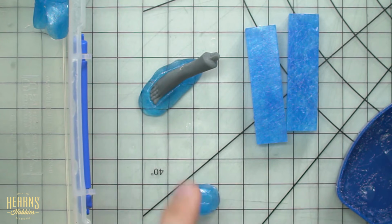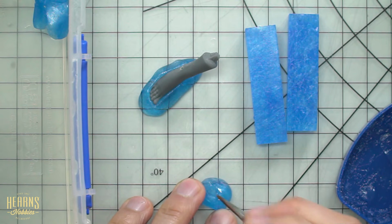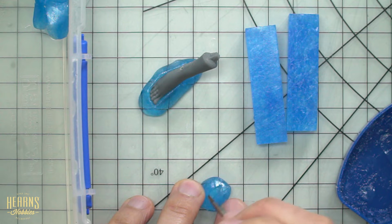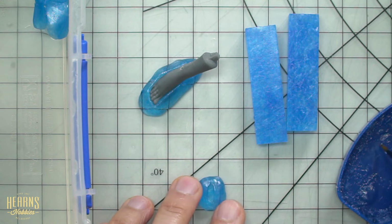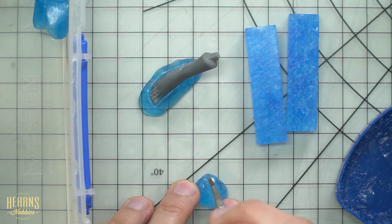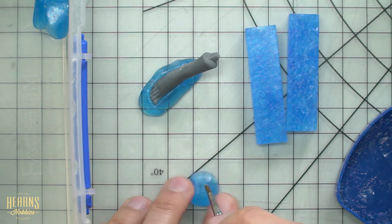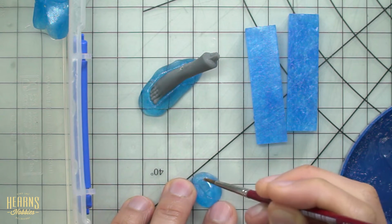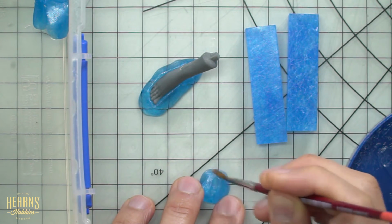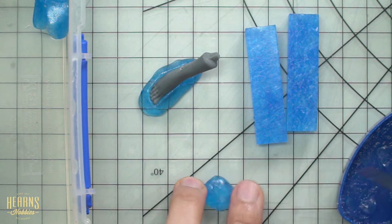All right, there's our mold. I've got the Vaseline on here, and we'll just brush it on the inside. Now try to get it in all the really tight nooks and crannies. Okay, all above, across the sides as well. And I'm going to put a coat across the top, just in case there's a bit of overflow when we squeeze the blue stuff on. We don't want it actually locking onto the blue stuff mold.